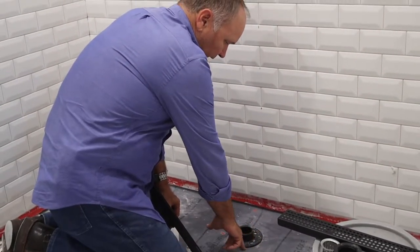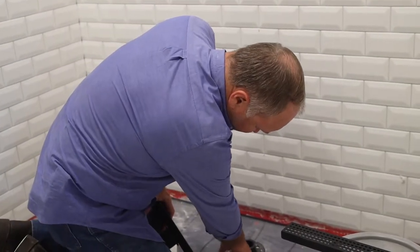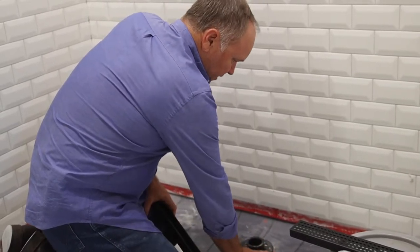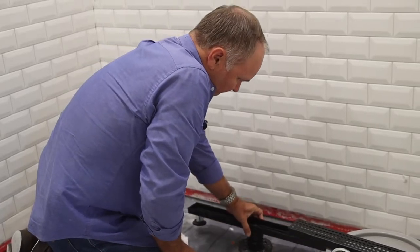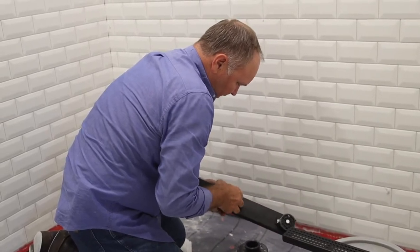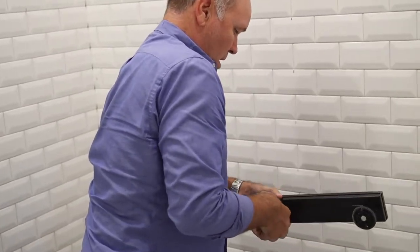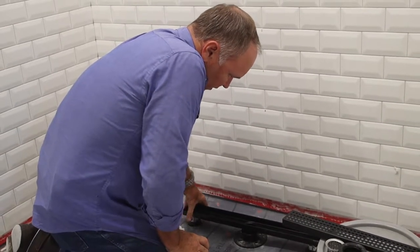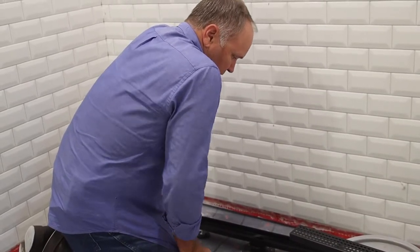The first part is right here where the flange is bolted in, allowing water to come in through inlets. You may not realize that the tile sits way up here — this is adjustable. You put your linear drain in there, pull off the protector, and set it to the right height for whatever height your tile is.